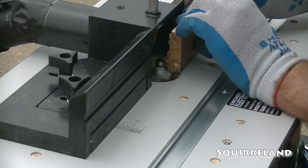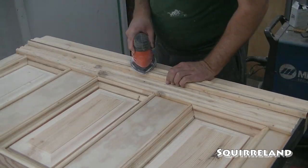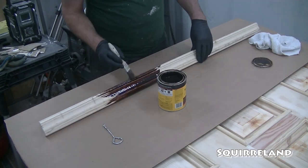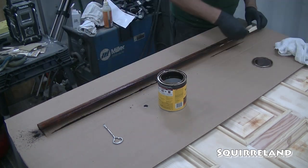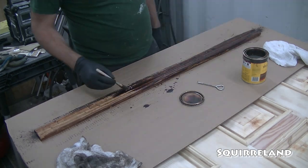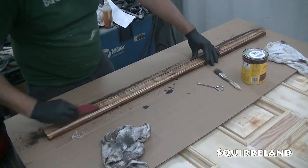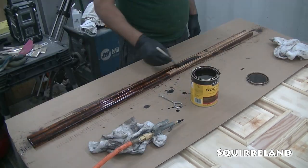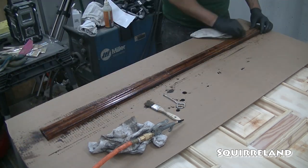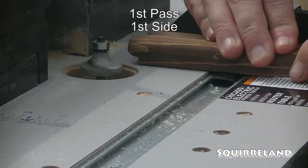Right now I'm working on the chair rail. I had to run this board through two different router bits to get the design that I was looking for. With the board cut the way that I like, it's time for some sanding, some wood stain, and some clear coat. I had to keep staining and re-staining this board to finally get the color that I was after — it kept coming out much lighter than I wanted. Now that I got the chair rail to match the color of the wood paneling, I needed to cut the ends with a router bit so that it could fit into the curve of the trim boards that will be on either side of this panel.